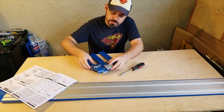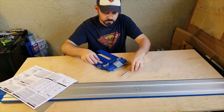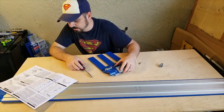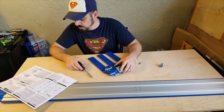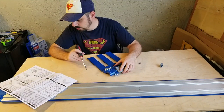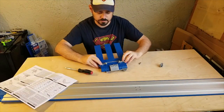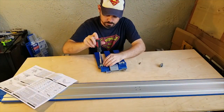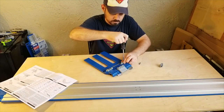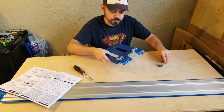The index piece is this little rectangular part, so I'm going to remove that — there's a hex nut on the opposite side. Next step is to loosen the set screws and the base plate clamps. Those are these guys right here, these two screws. This is my first time doing this, so I'm not sure which side to put it on.